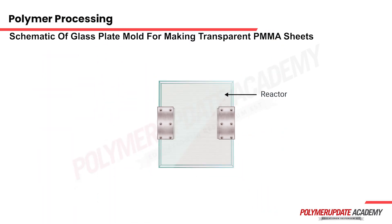You can have the glass reactor assembled by yourself. Then either you put your methyl methacrylate monomer, or you slightly polymerize it so that the viscosity increases — it is called acrylic syrup. That acrylic syrup, which has increased viscosity, is carefully poured into the space between the two glass plates.